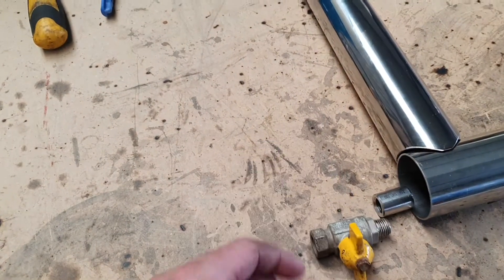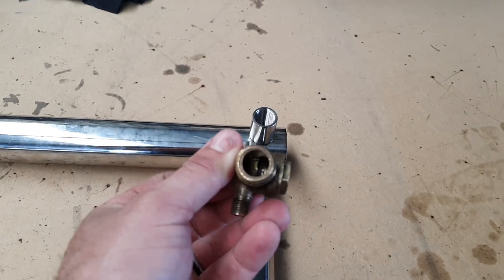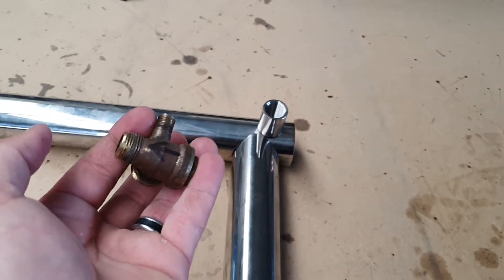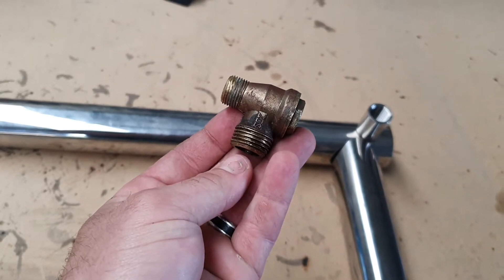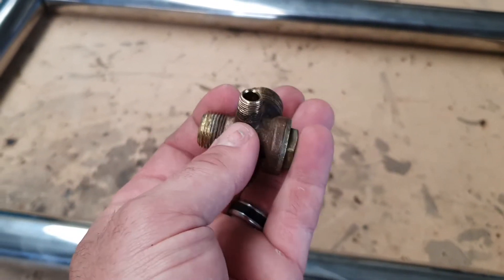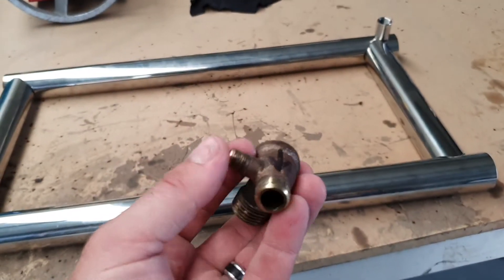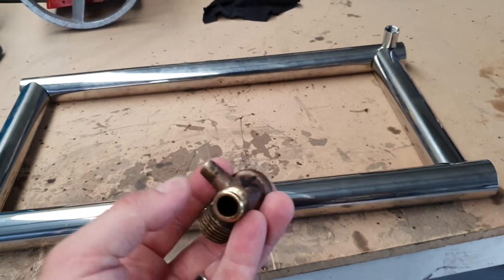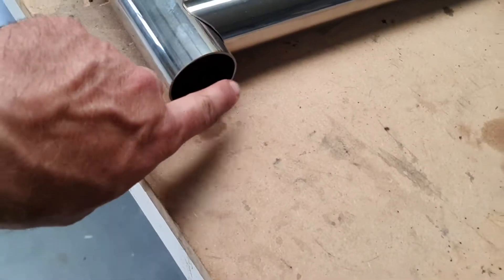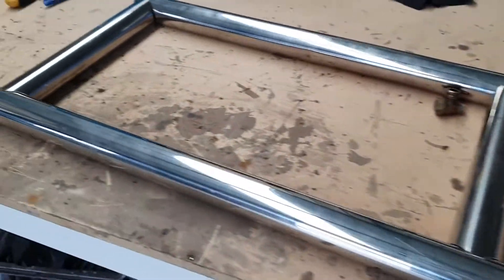Probably on the end we'll put a little quarter-inch bung so there's a tap to drain the tank out. Down the side under this cap there's a spring and a little valve — it won't let air go back from the tank to the head of the compressor, which usually leaks. So if your compressor shuts off, you're not going to lose all your air. The little side one — I'll put a tap on that so if the motor stalls, you can release this tap, which takes all the pressure off the compressor head and makes the motor a lot easier to restart. I'm also going to make the end caps and drill holes so this becomes your reserve air cylinder.